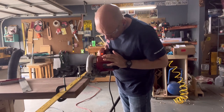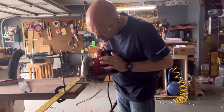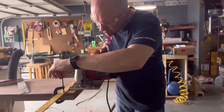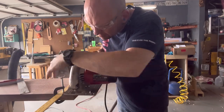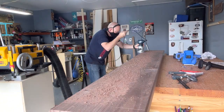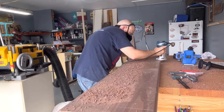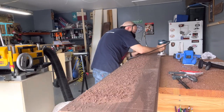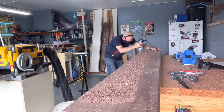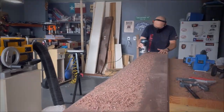Next step was trimming off the ends and making them perfectly square — I used a straight edge with my circular saw, a method I use all the time that works really well. The customer decided to go with a chamfer around it, so I took my palm router and went around it with a quarter-inch chamfer — might have been a half inch — and gave it a nice chamfered edge all the way around.